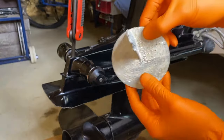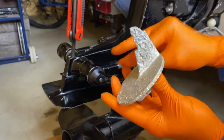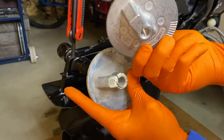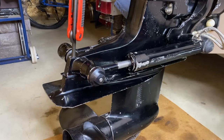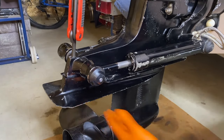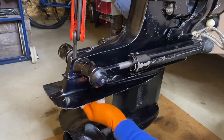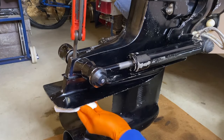We replaced this in previous videos during our lower unit rebuild — what a difference from the new one, look at that. Next, go down below and inspect the entire mating surface that the new anode will mate up against, and remove as much debris and corrosion as you can. In our case, we did this during the rebuild of the lower unit, so ours is clean — I'm just knocking off any dust that has accumulated.